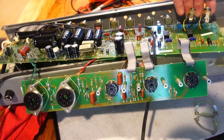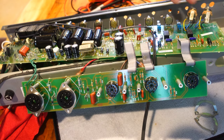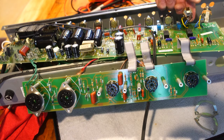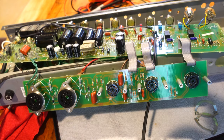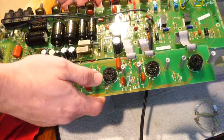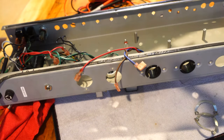Another known problem was that the input jacks on these are similar types — these plastic ones — they break all the time. Mine broke; one of them the other one was okay, so I ended up basically resoldering in some real jacks and doing the wires directly to the board. But ultimately this could just be drop-and-replaced to anyone's machine that they wanted.